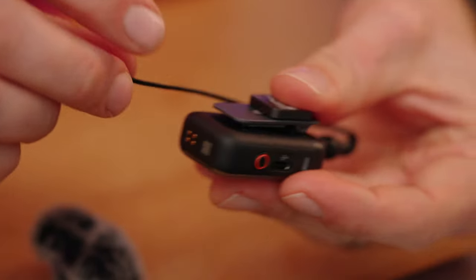The next setting is transmitter gain — the gain you adjust inside the transmitter. This is useful when one transmitter is on a loud person and the other on a quiet person. For example, if you set one to plus 12 and the other to minus 12, you'll see on the home screen that one transmitter's audio goes in much hotter than the other. I'll show you later in this video how to set the correct transmitter gain for your situation.